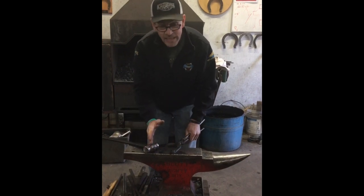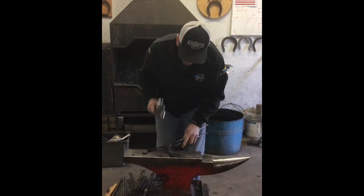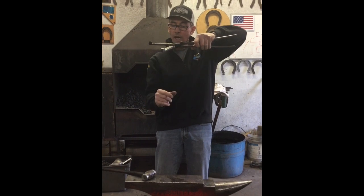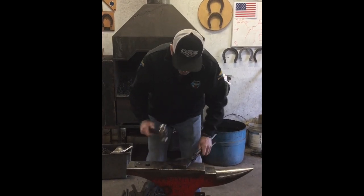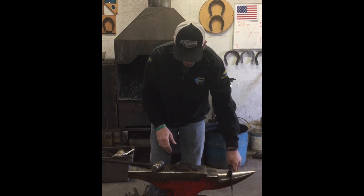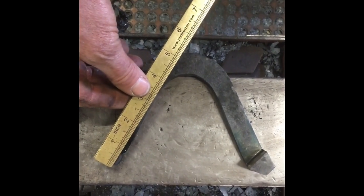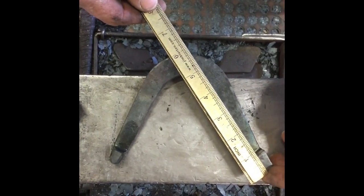Most people work ergonomically with their arm like this, and when they drop it down they're always caving it in to the inside corner. You want to be able to move your tongs and hit that heel cock in all different directions — you should be able to hit it to make it slump towards you if that's what you want. With the heel cock on this side, every time you hit it it works as lateral support, which is what you'd like. We've got a little under five and a half on this side, and just over five and a half — almost five and three-quarter — on the lateral side.